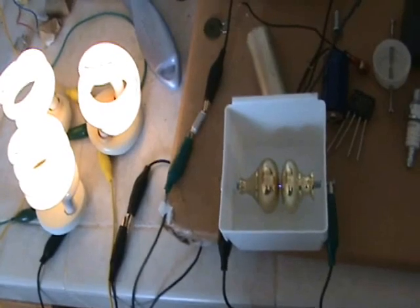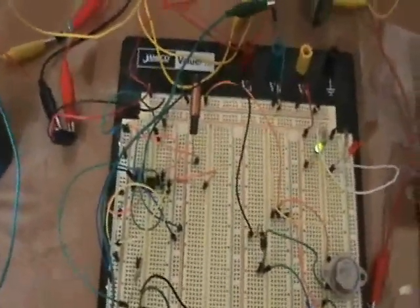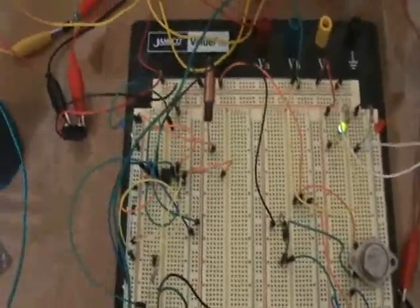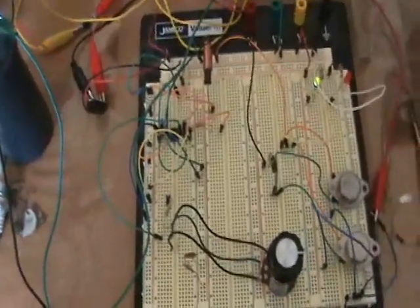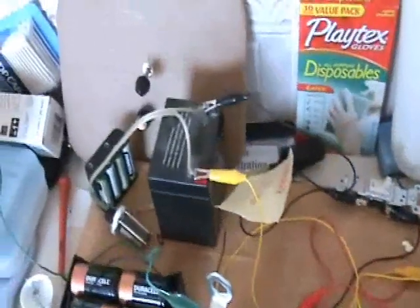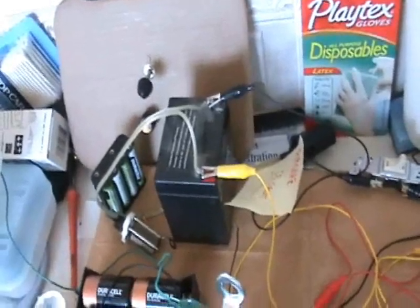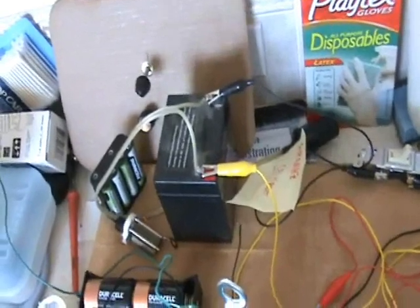The lights get the brightest at that resonant point. There's also a diode here, so the back EMF from the primary coil when it's pulsing in the opposite direction goes across the diode directly into the positive of the battery, charging it again. So all of the back EMF pulses are recaptured back into the battery.